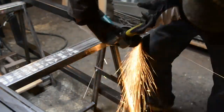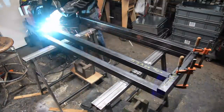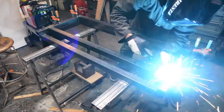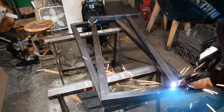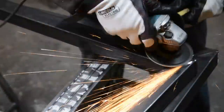Considering this is the seat, I want to make sure there are no proud welds. Now because I have a back going up against the seat, I have a guide for my exact shape — I'm using the seat frame as a guide for my back frame and I'm tacking it together. I kept checking that I wasn't twisted. My horses are level left to right, and because my frame was level on top of those horses, my back was level on top of the frame — that's important because once it's twisted it's difficult to untwist.